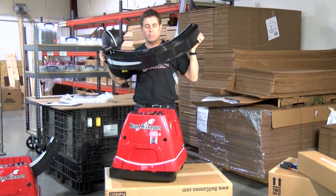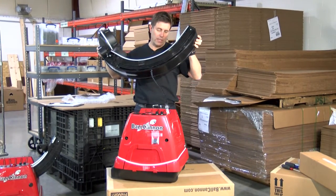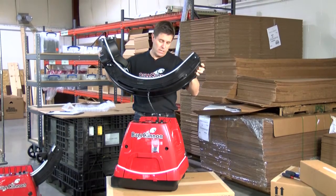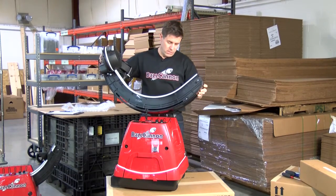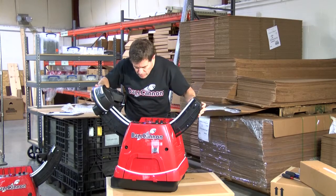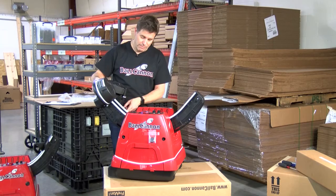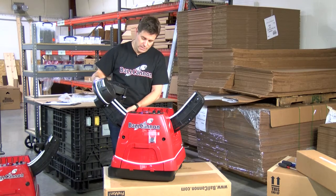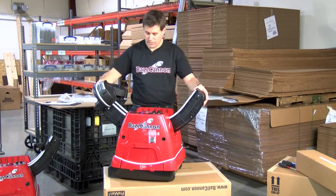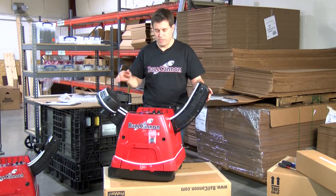There's a little Ziploc bag that's on the end of the guide rail assembly wiring harness to make sure that the connectors don't get caught in the slot in the enclosure. Slowly lower it into the enclosure. There's a guide rail setup pin on the opposite side of the guide rail assembly that's meant to make sure that the guide rail assembly doesn't fall down too low. We'll remove that later.